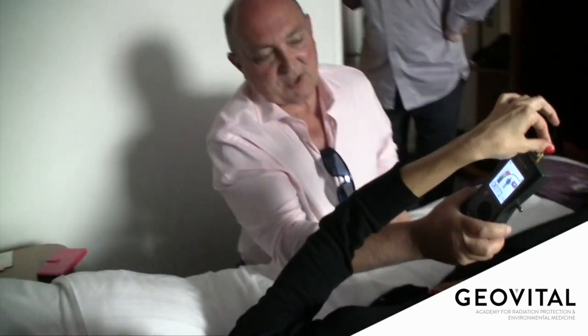So where does this leave us? I think this is a nice unit to go around and measure devices with to see what produces radio frequency radiation, but not necessarily the instrument to go in a bedroom and say, 'are the levels okay, should we protect ourselves with shielding?' The Trifield Meter remains a great tool to measure magnetic fields with — for electric fields and radio frequency radiation it's nice that it has it, but keep in mind that for those two areas you will need the help of a professional. By all means use this tool to go house hunting and find a property, and when you think you've got the right one, get a professional to come through and check your work with their instrumentation. The electric fields and radio frequency radiation are normally addressable, whereas magnetic fields is the thing we're trying to avoid.